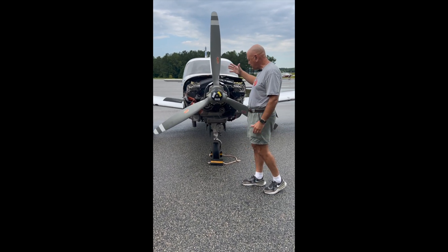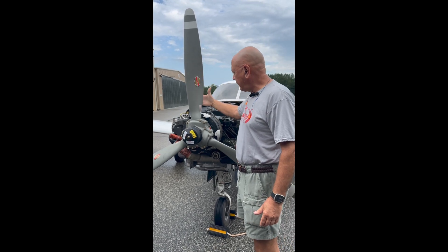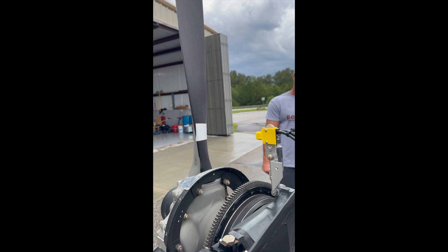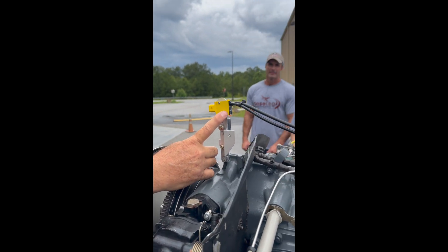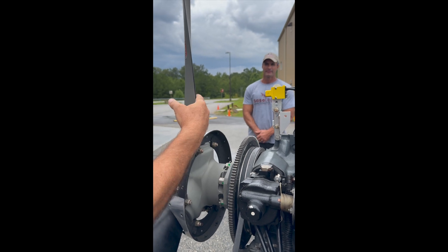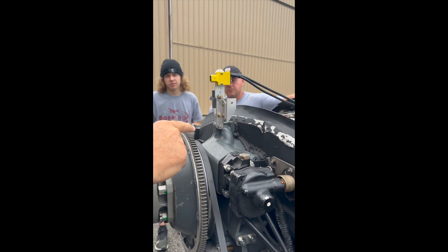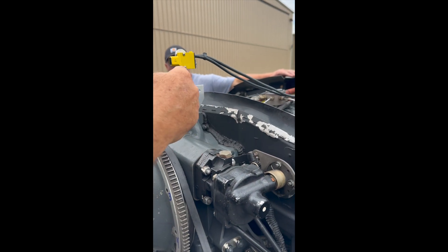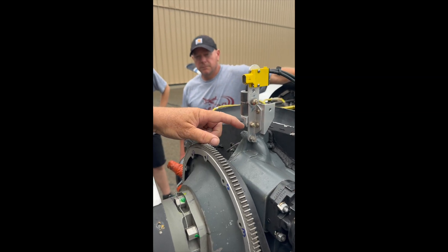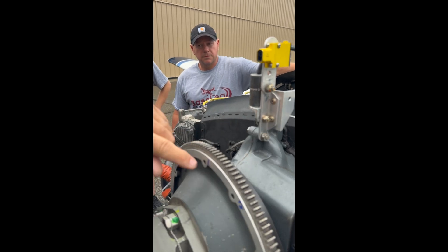Here are some key things. First off, you want to pick a blade to be number one blade — it doesn't matter which one. Coming around the backside here, you can see the reflective tape, and that reflective tape is used to pick up right here on the RPM sensor. This is an optical sensor. Basically I power up the box, it puts out a little red light, and I'll stick this to the backside of the blade. We also have the vibration sensor right here. We want to make certain that's 90 degrees to the crankcase when we mount it and as close to the front prop flange as you can get. On a stock Lycoming you can usually pick up the front crankcase bolt, pull it off, and make sure the sensor is on the center line.